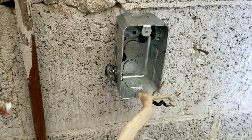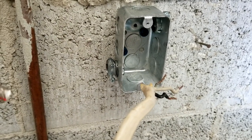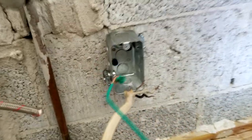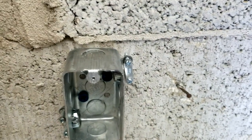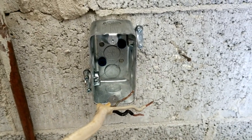This is a metal box, and per code — per National Electric Code — anytime you have a metal box you need to connect up a bond, or what we call the ground. You have to connect this to the system ground, and I usually do that with a piece of wire like this. I buy these by the box because I go through so many of them. We're going to screw it in — you can see there's a little mound in the back — and it'll come out and we'll connect this to both grounds here, one from each side.